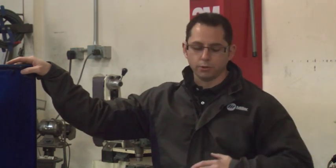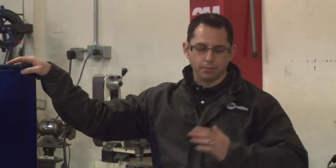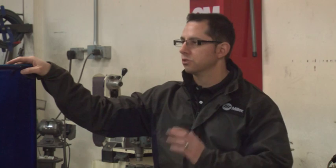The biggest difference between the two machines is the 180, aside from the nominal 15 amps additional output capability, is the fact that this machine can run off of both 115 volt and 230 volt input power. On that 230 volt side, this is the big thing — this really is the differentiator between the transformer-based machines and the smaller inverters: on the 230 volt side, all you need is a 30 amp breaker in your garage. So it's not like you have to wire it up for some huge amperage output, which reduces the cost if you were to go that direction and set your garage up.